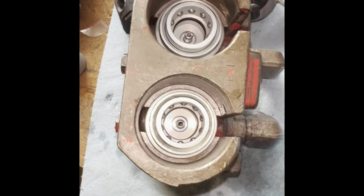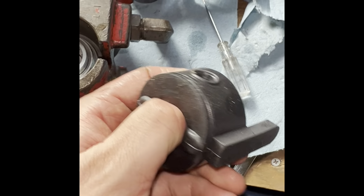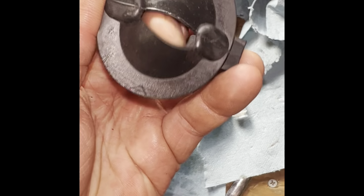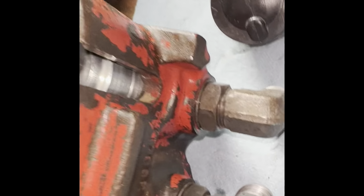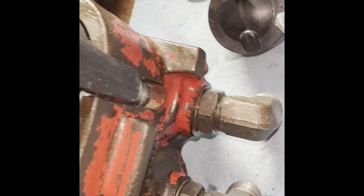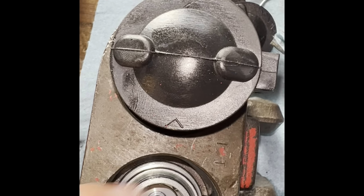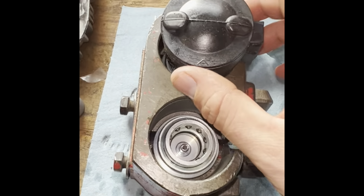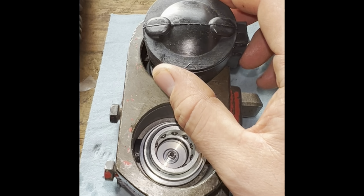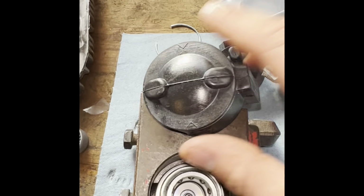There we go. So, what you've got to do with the next step is these dust caps. They're pre-slit in the middle for your coupling to go through. And you can see they fit in the slot of the old handle for the original valve. If you look at them, they have these little triangles on them, on the top or bottom. That's because these kits work for either side, left-hand side or right-hand side of the tractor. So this remote is the left remote. So that's how it's going to go.